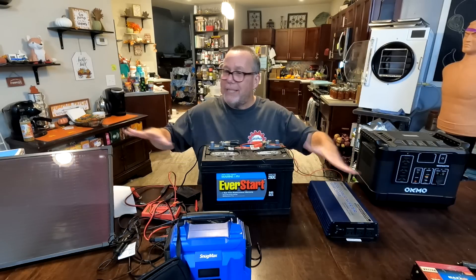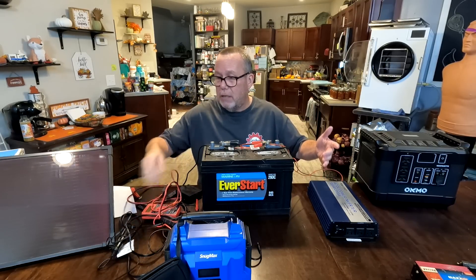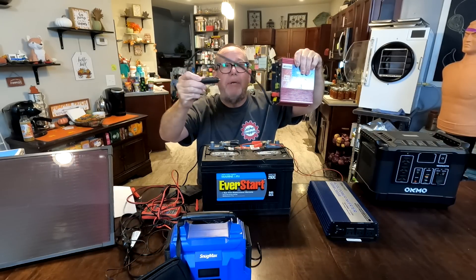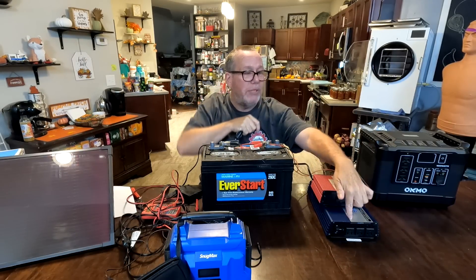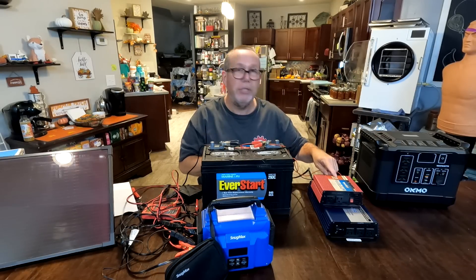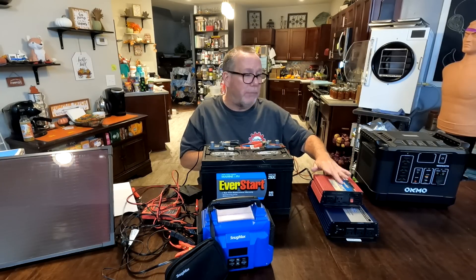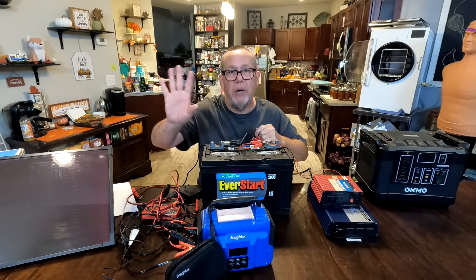Overall, doing this piecemeal method is cheaper but just ugly — there's stuff everywhere. Here's a little tiny 350-watt inverter that can plug into your car adapter or have wires hooked to it — it works exactly the same as the 1,000-watt one, just less power. If you don't need a whole lot — maybe just enough to power a CPAP machine to stay alive — you might scale things down and just buy one of these smaller inverters.